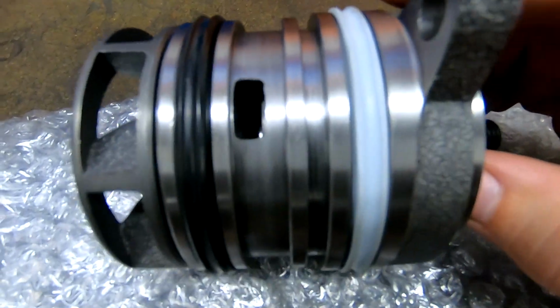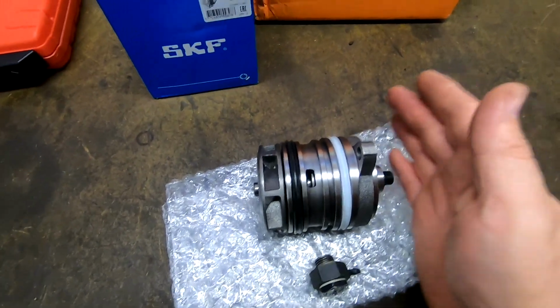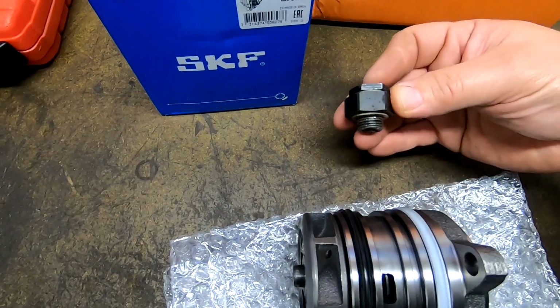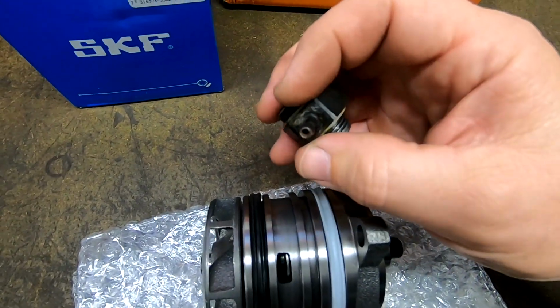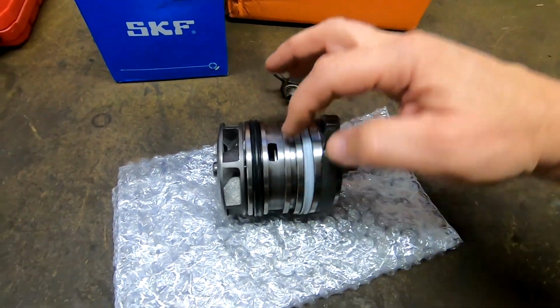Now, this little hole there, can you see inside? You might be able to see the shaft turning. That's the interspace that I was talking about. When you look at the engine, this is the outside, this is the inside, the engine's here, and this is the back, if that makes sense. This is the banjo fitting that was fitted to the block. Basically, any water, or oil, sorry, that gets through that seal, or through the shaft, should come out here, go out through this fitting, then through that tiny little hole, along a hose about that long, and drip out the bottom. I'm sure it worked for a couple of years before the engine got mucky and it got blocked up, because this one, if you saw my last video, was block solid. Sorry, I hope I'm not going on too long, but that's what I mean by the interspace. It's basically the gap between.